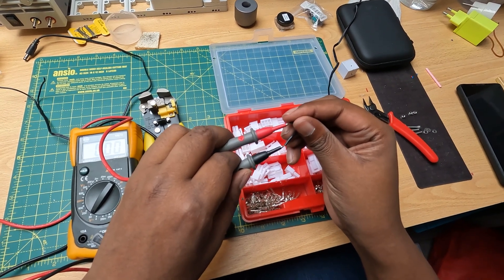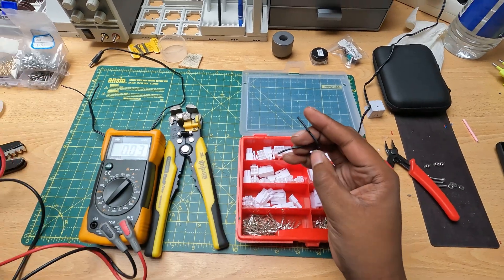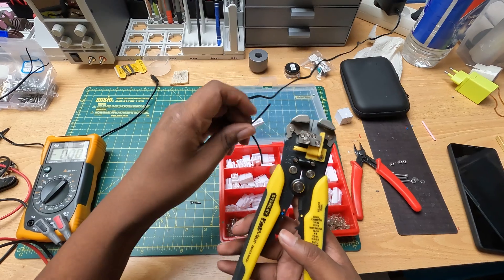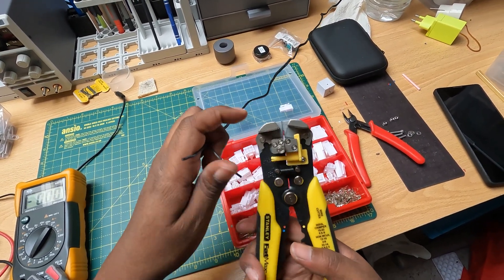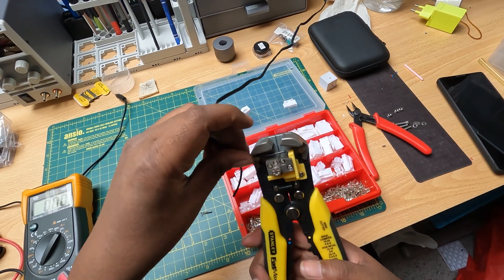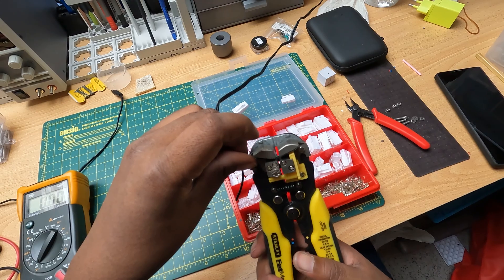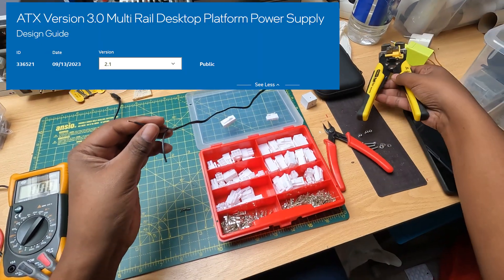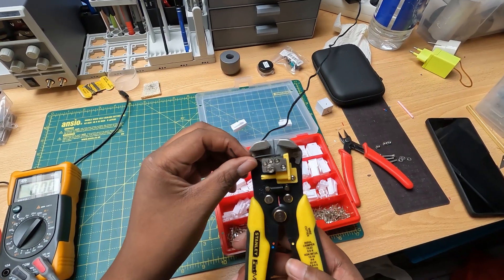It's been about a year with the 4090 and some of them burning through. In the end it came down to a very tight margin, as I've spoken about in a previous video, and there have been some issues especially around cable bending. Intel also released a new spec — ATX 3.1 — where they've made some changes to give a little more leeway in this connector.